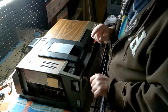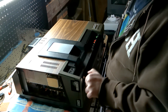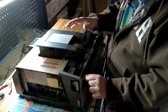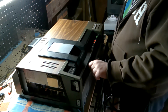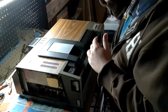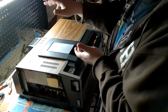You're going to see the oddest thing about this format. You can see this little knob that you can slide back and forth. To insert a tape, you push this a little, and then a very violent mechanism, you just pop that down, and then you slide this. Because of how the tapes work, they're stacked. It's a half inch tape, but the reels are stacked on top of each other, so the cassette is thick as all hell, and the actual drum goes in a little opening with a spool, in that slot.